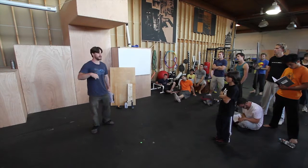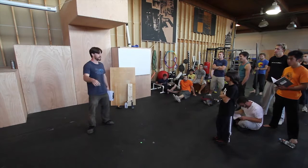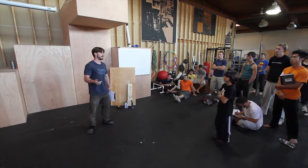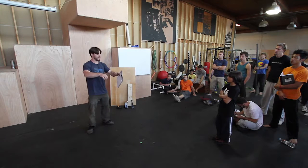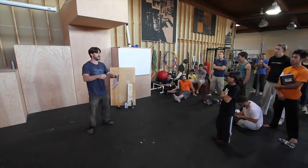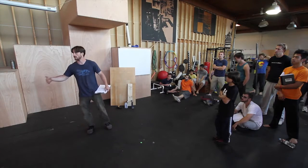Railings that are embedded entirely in concrete can still have this problem. The concrete will crack over time, and they can bounce out, right? If there's only a couple of bolts in them, or the bolts are loose, eventually they will get looser and looser and looser, and they will pop out, right? If those railings fit into each other and don't do it all that well, or they don't add the additional screws that they need to fasten it, same thing with those. They will eventually separate from each other, or they will get bent, which will add to the problem, and it will continue on and on and on.